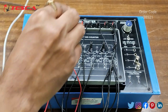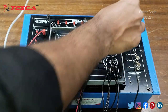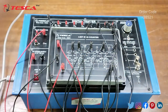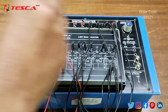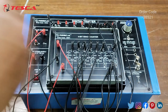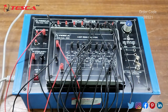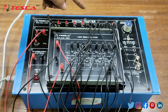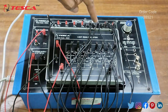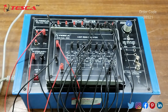Now I will connect Q3 to the fourth LED. Next I have to connect PR0, PR1, PR2, and PR3, which are the presets, to the input switches. All presets from 0 to 3 are connected to data input switches. Now we have to keep all the preset switch positions at high, providing logic one from the data input switches to presets PR0, PR1, PR2, and PR3.